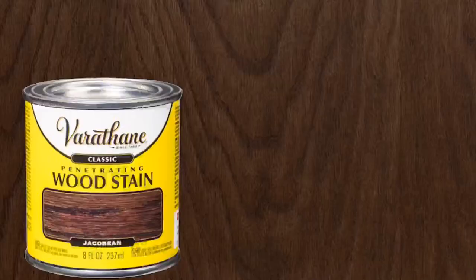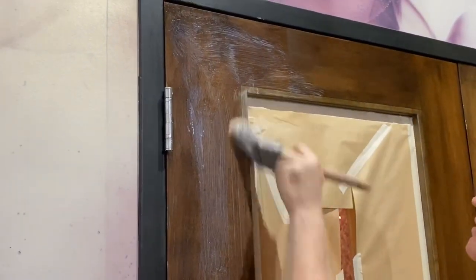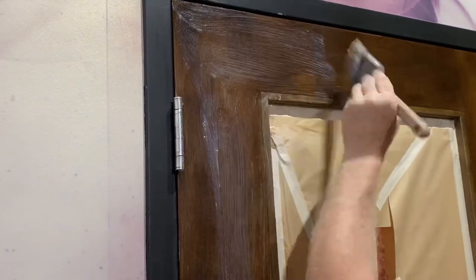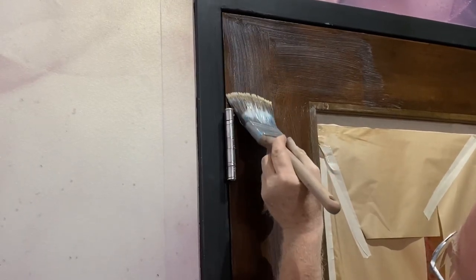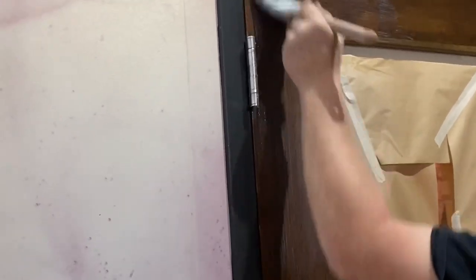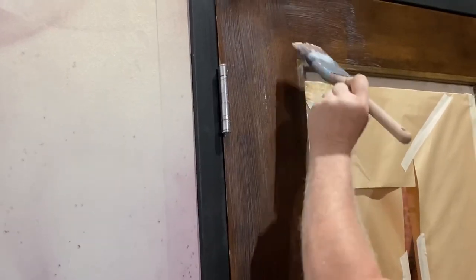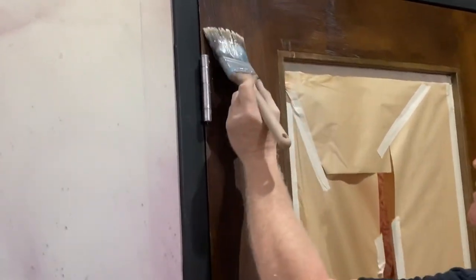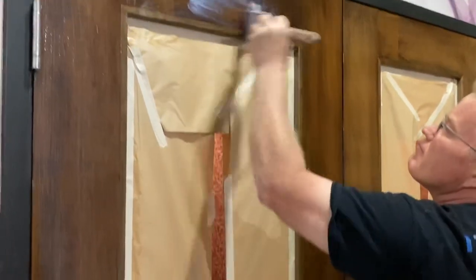This is the product I used before the clear coat — a fine product by Varathane, and you can get it in high gloss or low luster satin. I highly recommend the satin finish — it's the way to go. High gloss reflects so much light you can't enjoy the beauty of the wood. With a satin finish, you can see beyond the clear coat and appreciate the profile and beauty of the wood grain, rather than having it obscured by a high gloss.